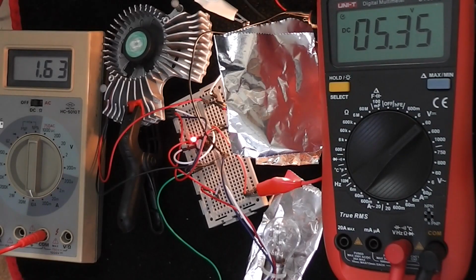As a reference, I've used the band gap of a red LED to drive the IRF540N, taking a nominal 12 volts DC to approximately 5 volts DC at 1 amp output. Other output voltages are achievable by using different coloured LEDs or stacking them in series, or you could simply use a small wattage Zener diode.